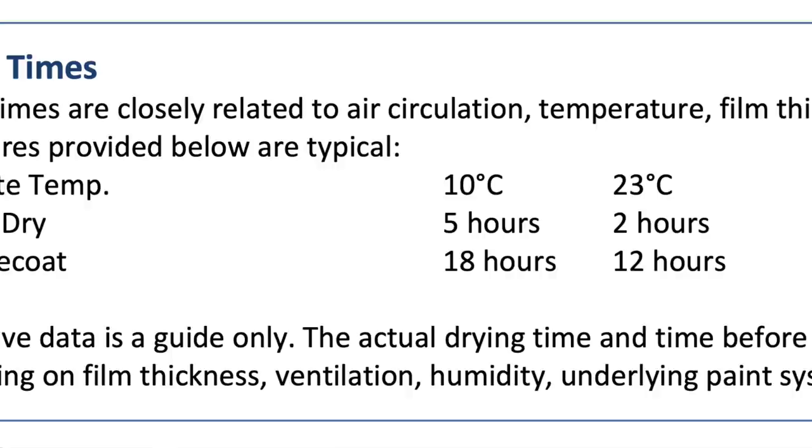And the drying times, I'm just going to refer to my computer, for the SML Ballastic at 10 degrees C, and I think I mentioned we were around 7-8 degrees, is 18 hours between coats. Now, we actually left a day between coats. We arranged to come out for the whole week, so the idea was a coat per day. I wanted to give three coats, although they recommend two. I wanted to give three coats, and then it gave us 4 days hardening off before we went back in the water.